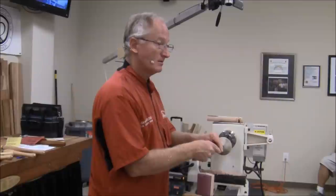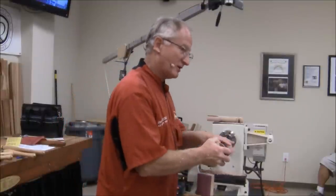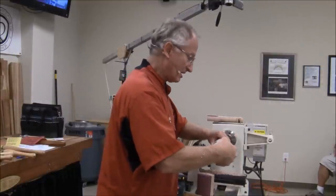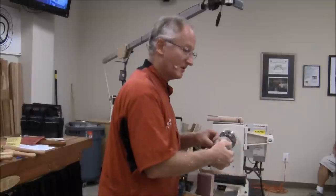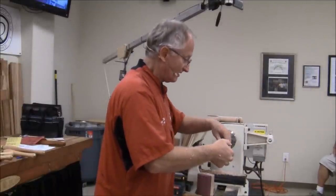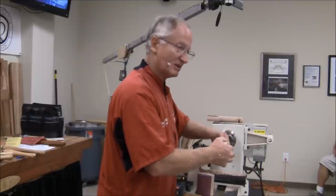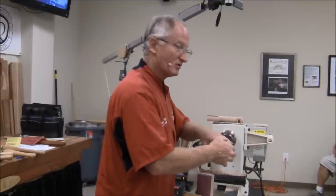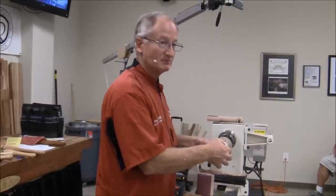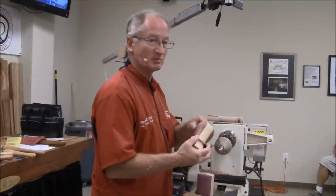So you'd put it in, put the tailstock in, then you'd move that up to the work. Now you're putting the tailstock in, it's tight. And then you'd move that up to stabilize it. And all that does is keep it. All this does is just this. I don't have the Allen wrench with me that fits this, but this just slides up and holds that in place. That's all it does. This is your weight bearing surface, the bottom of this, not the top. Because if you did that, there's a good chance you would split the top of it.